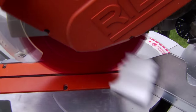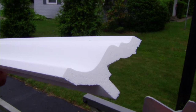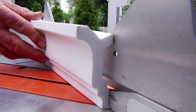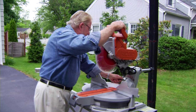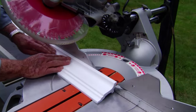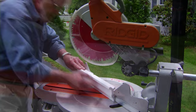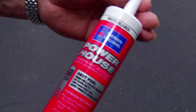To begin the installation, I cut a 45-degree miter on the end of one molding section. I can make this cut either by moving the miter saw table to the 45-degree position and setting the molding vertically, or by tilting the blade to a 45-degree bevel and laying the molding flat on the saw bed. Today I'll be cutting with the material in the vertical position.